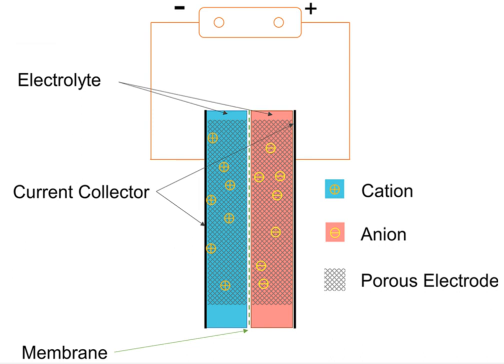Pseudocapacitance is accompanied with an electron charge transfer between electrolyte and electrode coming from a desolvated and adsorbed ion whereby only one electron per charge unit is participating. This Faradaic charge transfer originates by a very fast sequence of reversible redox, intercalation or electrosorption processes. The adsorbed ion has no chemical reaction with the atoms of the electrode, no chemical bonds arise since only a charge transfer takes place. The electrons involved in the Faradaic processes are transferred to or from valence electron states orbitals of the redox electrode reagent.